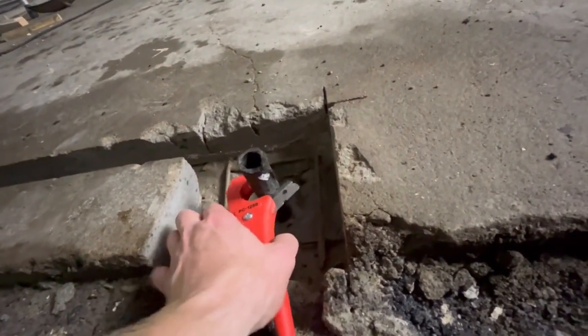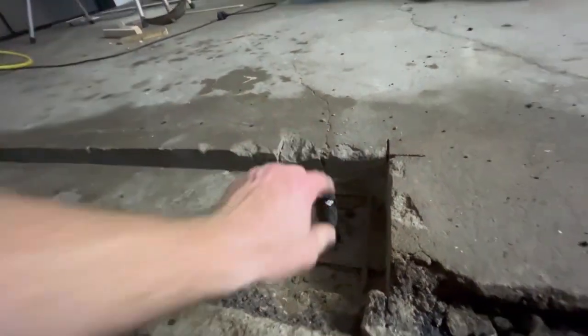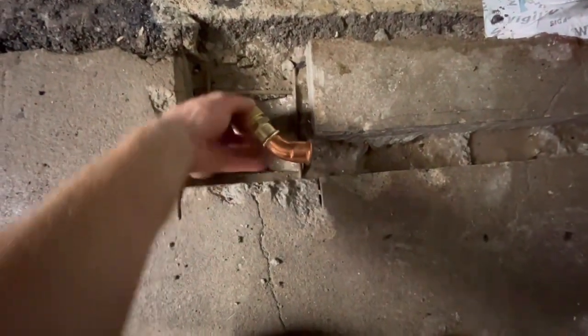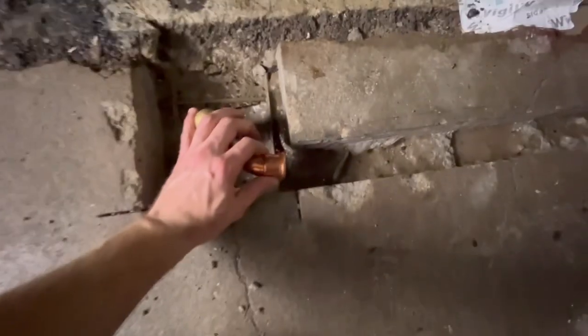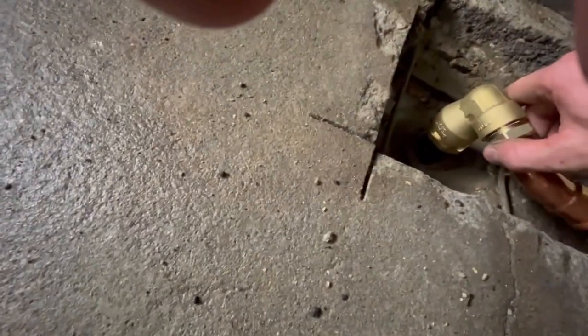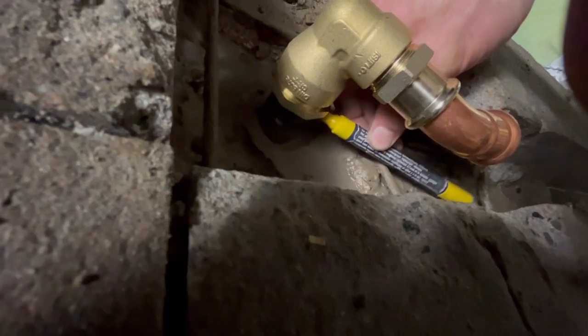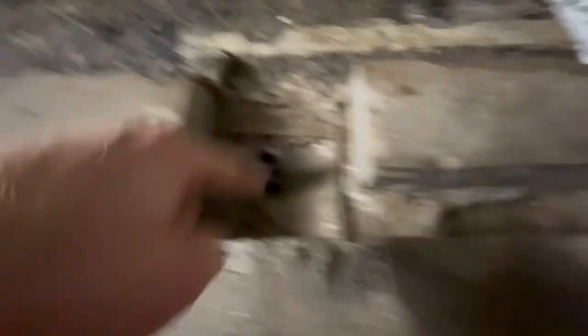Before throwing in the towel today I'm going to cut this pipe and try to fit the connectors. This part goes onto that one. I'll teach you something important: when you connect this one, push it down and put a mark, then take it up and measure from there — how far it should go in — so I'm sure it's completely inside and won't leak.